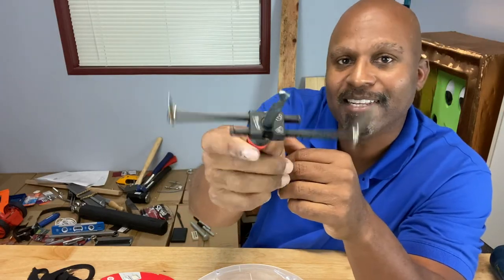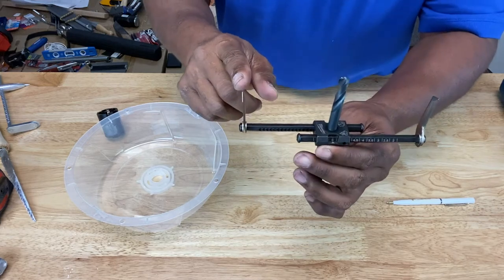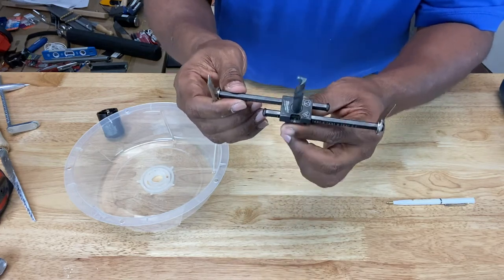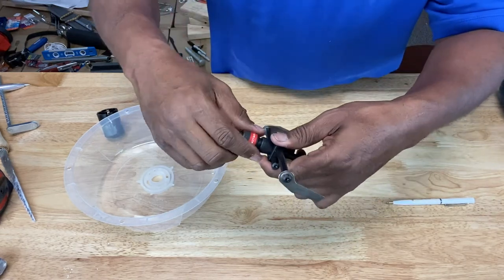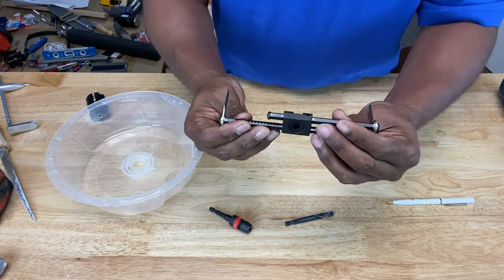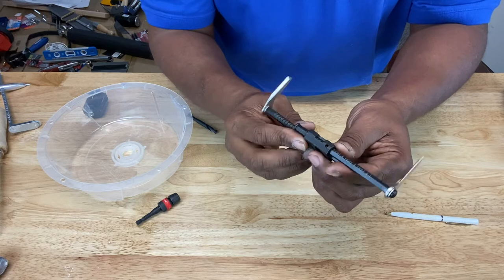Now this hole cutter makes it a lot easier to cut holes. The way it works is it has a drill bit and two blades on opposite sides of the drill bit that complete the diameter of the circle you're going to cut. It's adjustable — to adjust it, you pull it apart and take the drill bit off. You can adjust it to any circumference up to about seven inches. The diameter of a can light cutout hole max should be about six and three-eighths inches, so this tool definitely covers that.